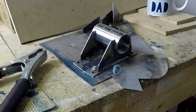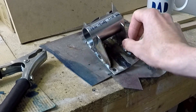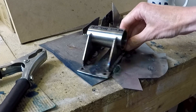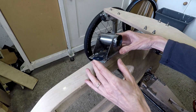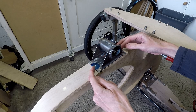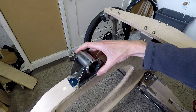I've got the bottom bracket shell in place and measured it so it's central. The right hand thread on an English bottom bracket is actually a left hand thread - an anti-clockwise to tighten thread. The thread on the left is a conventional right hand thread. I just needed to make sure I got those the right way round and marked it up on top to check. It's equally positioned left and right. Now to tack weld it in place and then fully weld the shell. I've completed my bottom bracket shell structure. This is now going to be bolted onto the top of the wooden frame with the four bolt holes and the two screw holes, and I can adjust the position of the bottom bracket shell to give a little bit of length adjustment.